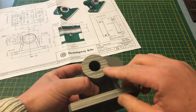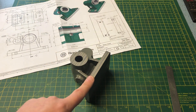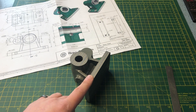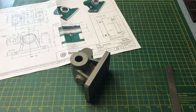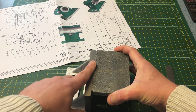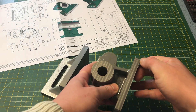For most of the work that I do, this method usually results in an acceptably flat surface. I think the finish is all okay on this, so I am going to go ahead and attach this to an angle plate to machine the second surface, which is the bottom of the casting. It will be at 90 degrees to the side just finished, and I am going to use a single piece of threaded bar to secure it to the angle plate. Obviously this isn't the most secure of setups, but I think for the depth of cut I am going to be taking, in my experience, it is going to be okay. I will position this on the angle plate such that the clean-up cut will leave the base at a roughly equal thickness across its length.